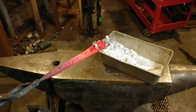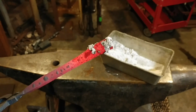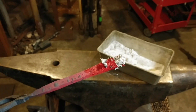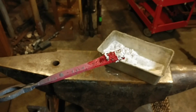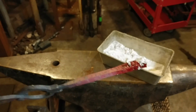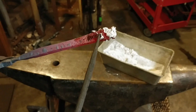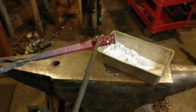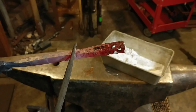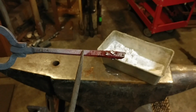I'm going to adjust the camera here so you can see a little bit better. This is the same piece of steel, and do you notice that big scale piece is almost completely gone? Or right there, it is actually gone. That's the purpose of flux, is to eat scale. It does inhibit a little extra oxidization from the fire, but its main purpose is to clean the steel through capillary action. Now you can see this has created kind of a hard candy surface on there versus the other that is unfluxed. So I hope this will answer my subscribers' questions about flux and how to use it.